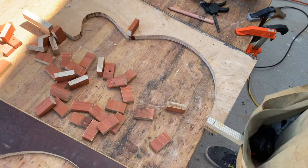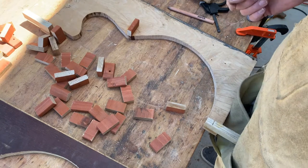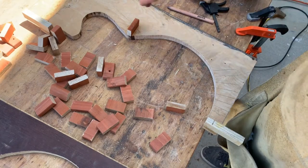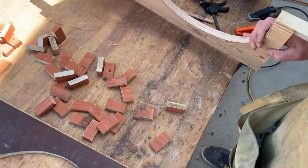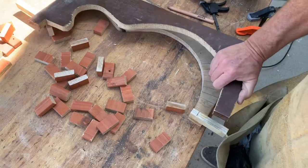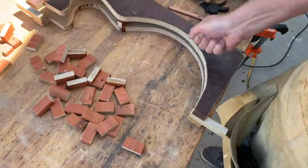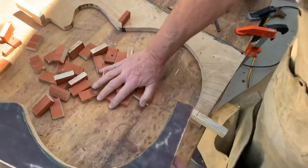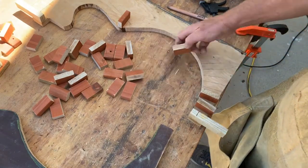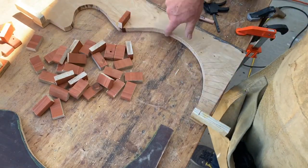On the form, I'm redoing it in the style of an acoustic guitar form from another book. Robert's book is great but I don't really have the kind of bandsaw to cut two-and-a-half-inch thick laminated plywood. So what I did is I took some three-quarter-inch plywood and cut the profile of the guitar — that was easier for me, I just did it with the saber saw, the little jigsaw. Then I got some cedar from the swing-set gazebo lumber and did a run of little one-inch blocks that we'll glue in here.